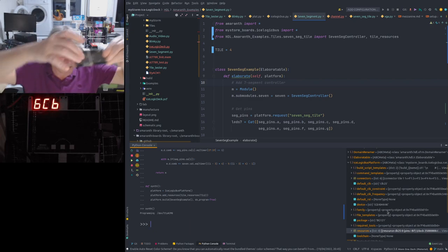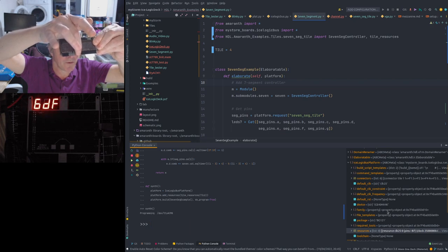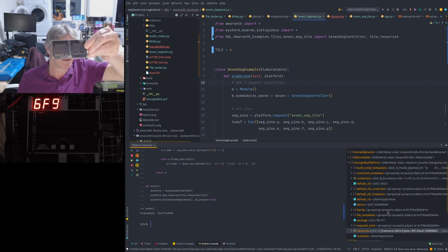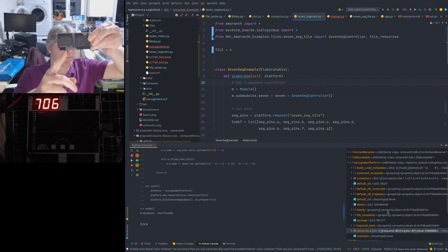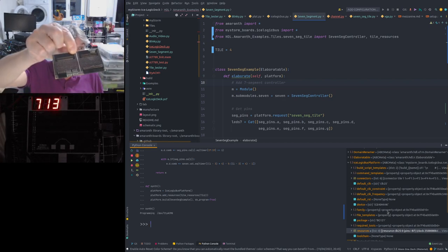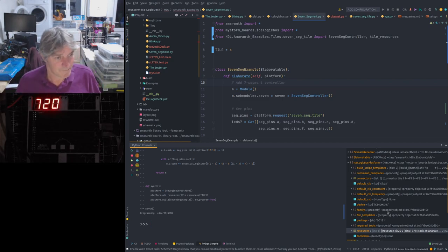There are some other little connector sockets on the bottom here that I haven't used. Those are a pair of two row 4 pins, with ground on one side, and those are perfect for connecting your logic analyzer to, if you want to expose the logic signals. And it shares the pins with this double P Mod here, so effectively it also acts like a P Mod extender, all in one board. Pretty cool, huh?